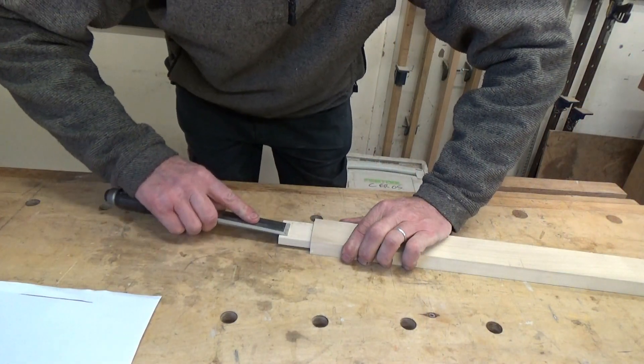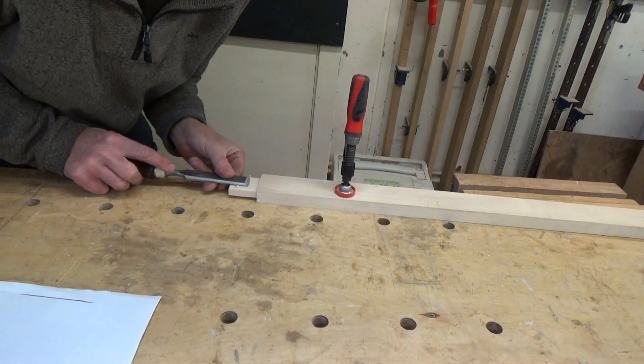Firstly, because you're more likely to end up with the red stuff on the wood, and also you don't get such a good cut because you're sort of battling against yourself all the time. If you can get both hands on the chisel rather than one hand holding the wood and one hand holding the chisel, then things are going to be a lot easier and less hectic.